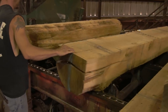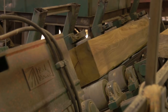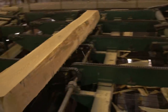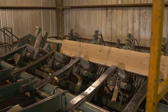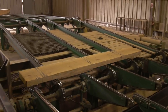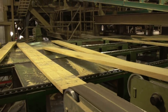So this is the big resaw — this is where the cant comes after the head saw. The guy marking the board is giving instructions to the guy in the box to tell him how to cut it. Because each one of these cants — some of them are going to be plain sawed and some are going to be quarter sawed. Every one is different, and that guy marking it is giving the direction. So now you're just cutting one board at a time? One board at a time, comes back around and cuts one board again. The boards come down and some of them have wane on them, which is bark or lack of wood — they go through the saw and clean up the sides.